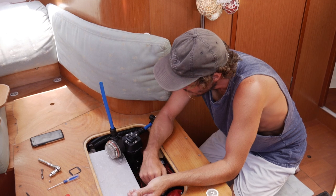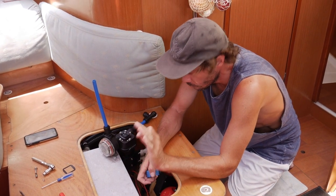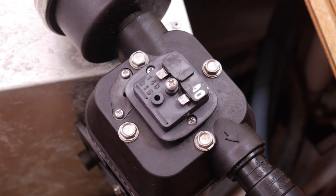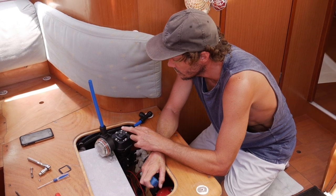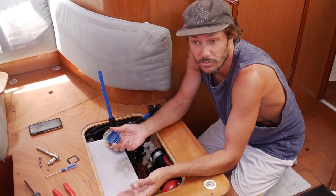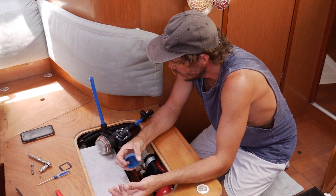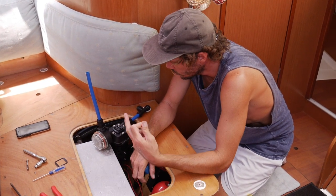Well, the valve did. And I've since discovered, from the people I've been talking to, that it's this regulator switch. Basically it wasn't regulating, it wasn't shutting off when it reaches a certain pressure. Ours is rated 40 psi, it should then stop pumping, turn off the pump, and they apparently have a tendency to go. So I'm replacing that right now.